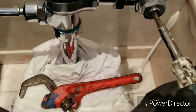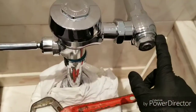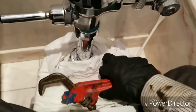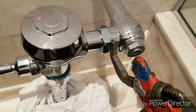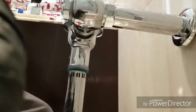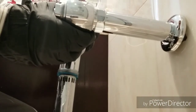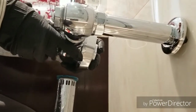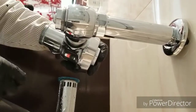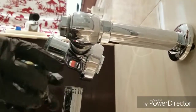I'm going to take the screwdriver to the angle stop, which I have shut off. Sometimes they do not hold, which means you will have to go to the branch valves, shut it off, and replace it — it just comes out. Next I'm going to take my spud wrench to this piece. I'm going to loosen this and this, but I like to loosen this one first and then loosen that one. I need two hands for this. Here's the old vacuum breaker.